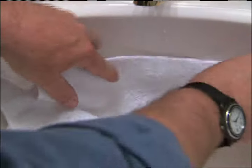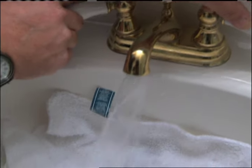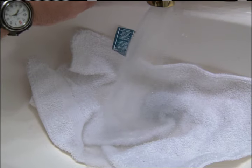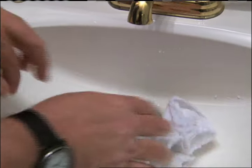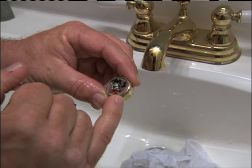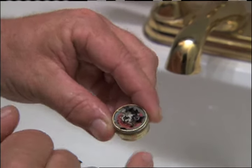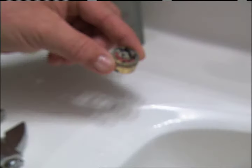I want to see what else is left in there, so I'm just going to put a rag down here and flush out that spout. That tells me I got it all. Just that little bit of debris was causing the water pressure to shut off almost completely — it must be going down into the flow restrictor. There's so much debris that I think we're going to just change the whole aerator. I could try and clean it out, but time is money.